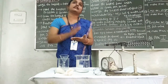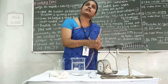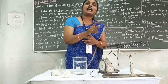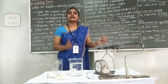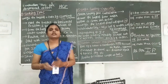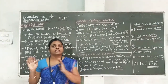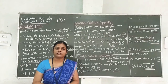Now W2 minus W1 — this is W, which means the water held by the cotton. This cotton has held water — it will be much more water. After 30 seconds, this gives the water holding capacity. The standard value is 23 grams per gram of cotton. If your value meets the standard, you can evaluate it and pass the absorbent cotton test. Today I have given a demonstration of sinking time, water holding capacity, and all the tests for evaluation of absorbent cotton. Thank you very much.